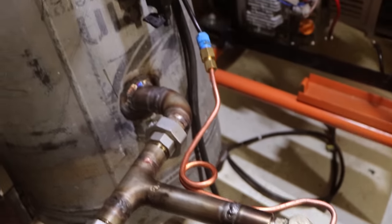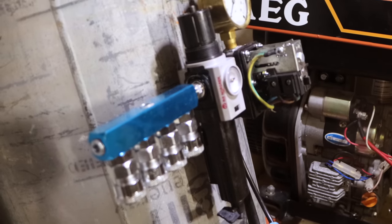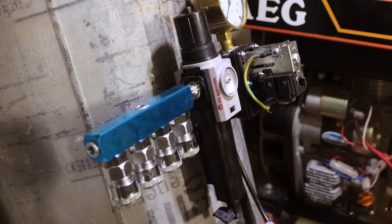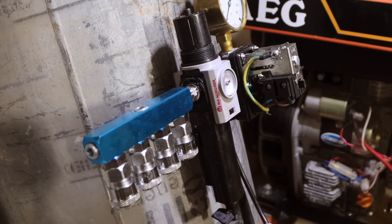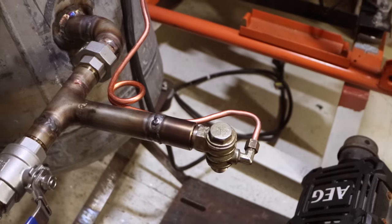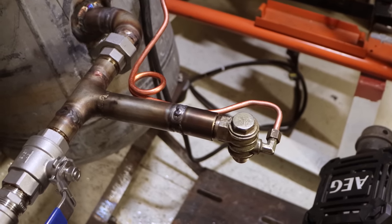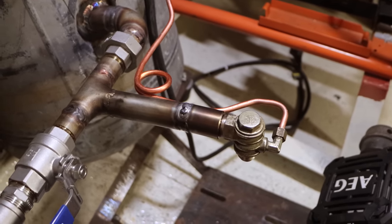This is the sensing line that runs from this one-way valve, heads all the way up to the regulator itself. So the regulator is getting two lots of pressure — before and after that valve. Before is the copper pipe, after is the tank. And that allows essentially — I think this is called an unloader valve — it basically allows the compressor itself to be able to start without having full tank pressure in there.